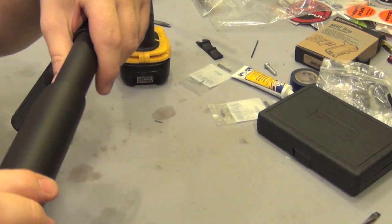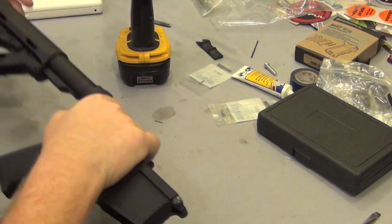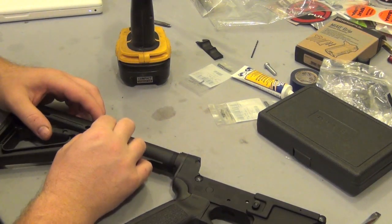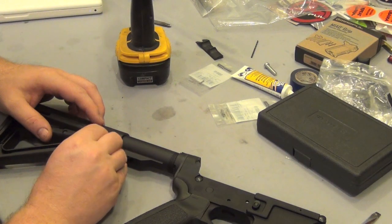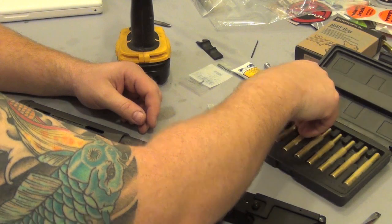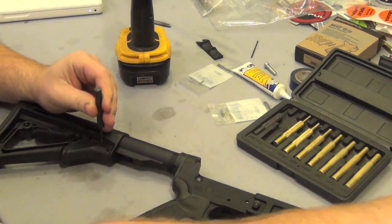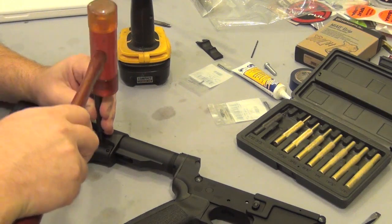Right now it's adjustable and I can see through my pin hole. I'm going to take the pin and place it in there like that. I'll get my punch set, start out a little bit bigger than the roll pin, and let's see if this works guys — it's going right in.